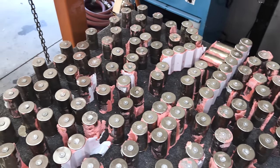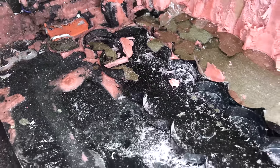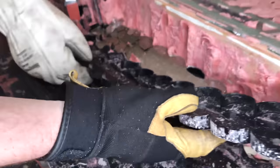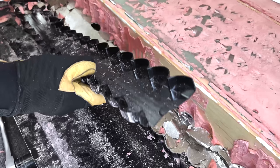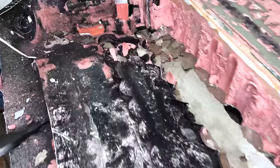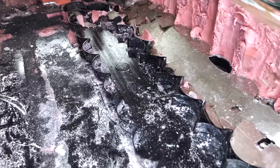There's a piece of plastic here. Antonio, do you want to run through what you see? This black plastic, which we didn't really appreciate when we had a single row of cells removed, is barely adhered — there's a little bit on the outside but the inner two have not had any adhesive. It's basically just a holder for the mica. If you look back at some of the older videos that Tesla released about their cell assembly process, you'll realize this was actually attached to the bottom of a bandolier of cells.